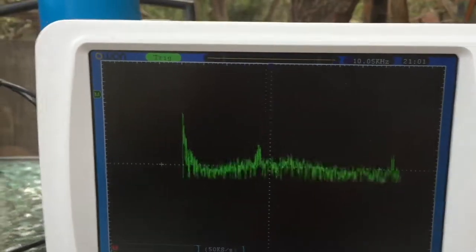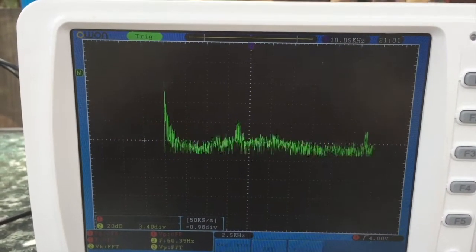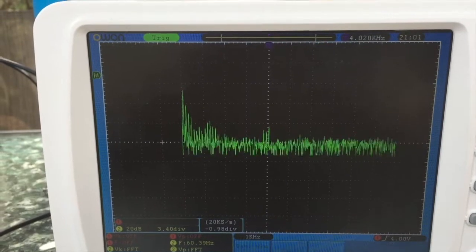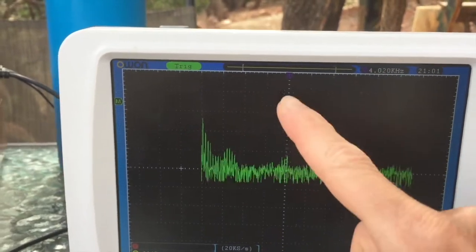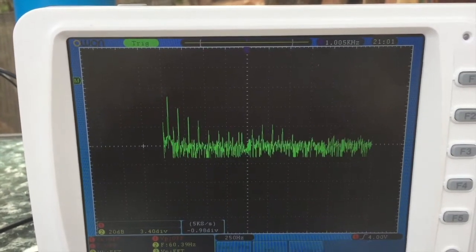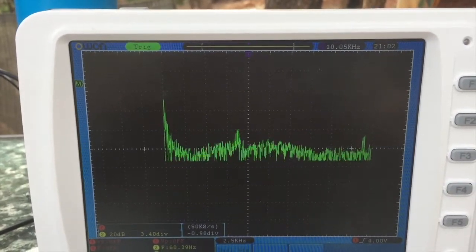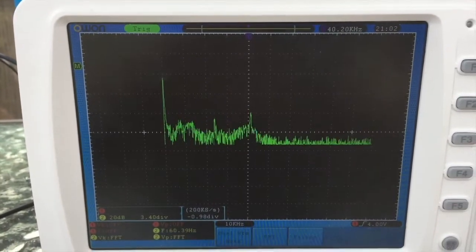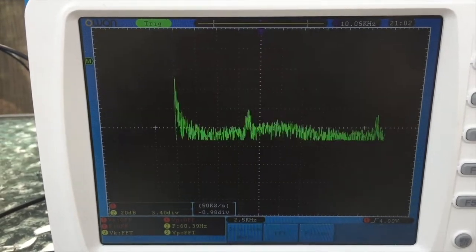This view can tell me at what frequency we're looking. I've got some signals right around eight kilohertz or so. There are spikes at four kilohertz, and you can see that measurement right up here. Zooming out, this is one kilohertz here. Looking at the spectrum a little more — there's four, there's that eight again — and it looks like we've got about 24 kilohertz and one right at 40 kilohertz. This helps us pinpoint what some of these sources are.